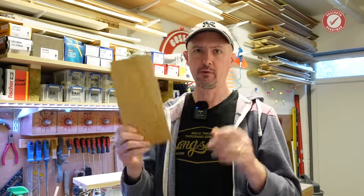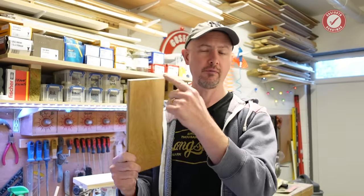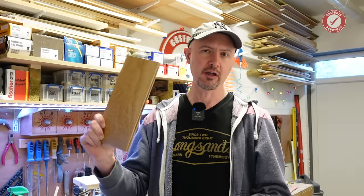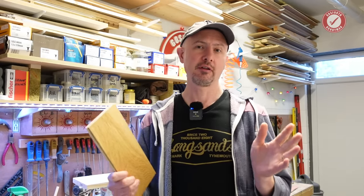This is a section of the floor that I'm using, which you may have already seen the video of when I fitted the floor. We do have a full 12mm expansion gap around the entire floor and you absolutely do need to account for expansion and contraction, especially if you're in an environment that's subject to massive deviations in humidity.